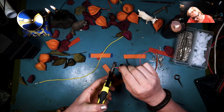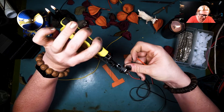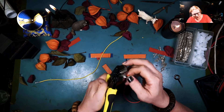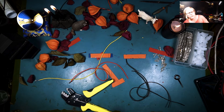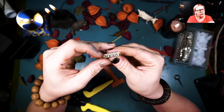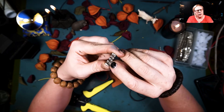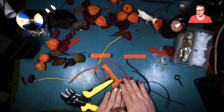It looks like it's really short but it's really not. I'm making sure that the strands are going just past the second set of wings. I haven't mastered this yet — this is kind of a new process for me. I am not going to claim that I'm a Molex expert by any stretch, because I've just started learning. Here we go — I can see the pins. Now I'm going to put this into the saddle; it's a double-stage saddle. There are two sets of wings and two steps in the saddle — one part is deeper than the other. The larger wings for the jacket go in this part, and the part for the actual wire goes in the other, and then crimp — done.